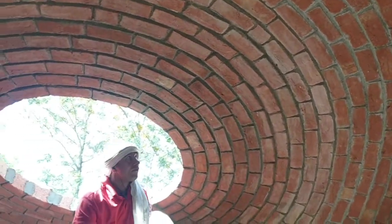A Rotak Dome is actually a shallow roof made just out of brick and cement by these extremely talented people from Rotak. It's a skill that just this family has and it's absolutely magical to see them build these roofs. Typically when we look at a roof, we think of steel, we think of concrete because that's how flat roofs have become now. But this roof is actually made without any steel and without any shuttering. The very talented team of Narayanji and his various nephews and family members can make this wonderful roof just using their skill, their intuition and their age-old knowledge, which they've inherited from their ancestors. It's a common roof used in Rotak for many projects and also for low-cost housing, which gives you an indication of how value for money it is.